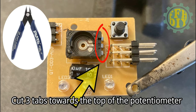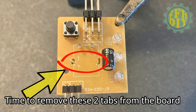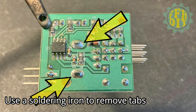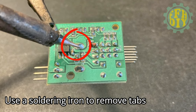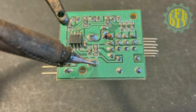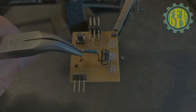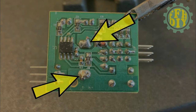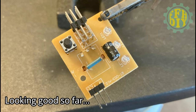Now we're going to cut the three tabs off the potentiometer, but you want to leave those legs on there for future soldering. Here's where the legs of the potentiometer that we just removed go. Now we're going to unsolder it off the board to completely remove it. Use your soldering iron on each leg on the other side of the board to remove the tabs. Now we're going to make a jumper wire — 20 or 22 gauge wire will work fine. Place that jumper wire into the two holes where the tabs were, solder it in place on the other side of the board.